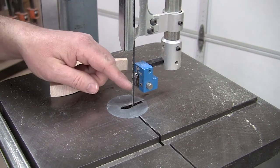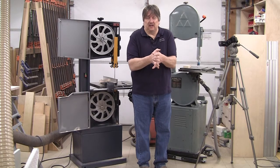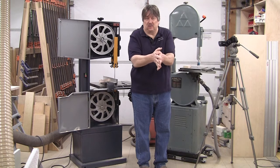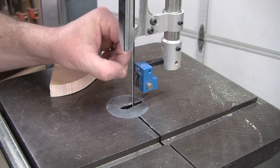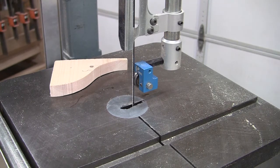And you've got to remember that when they set those teeth, they hardened everything afterwards. And when you essentially anneal the blade again, it has memory. It's going to want to go back to its original position. So if you get the blade warm enough, you'll start to lose set. And if you have side guides on there, by twisting it that much, you actually could physically make contact with the teeth and the side guides and knock the set out of the teeth altogether.